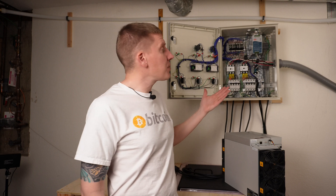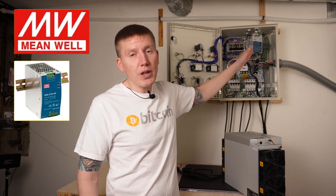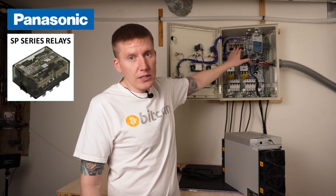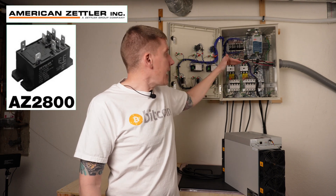So with the door open, you can see the complexity of what it takes to put something like this together. Walking through the individual components: I have a Meanwell power supply, 24 volts driving the whole thing. Meanwell makes a lot of really good DC power supplies — I have a link below for this one, but there are a lot of different models out there for bigger or smaller systems. Next to that, I have the low voltage latching relays for both temperature and flow. Below that, we have the definite purpose contactor relays and the pump relay. And then below that, I have all of the breakers, which protect my system in case there's a short in a miner.